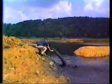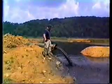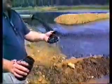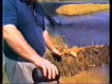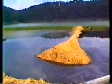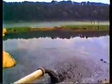At the other end of our discharge pipe, we are taking a gravity sample. What we have is 32% solids and a 1.19 specific gravity of slurry. Milkshake-like slurry. When it's dropped onto the ground, it barely flows, just a little bit. All these solids pass out into these earthen levees that were constructed for this project. The flow pattern through them is serpentine so that we can give maximum retention time and solids settling time.